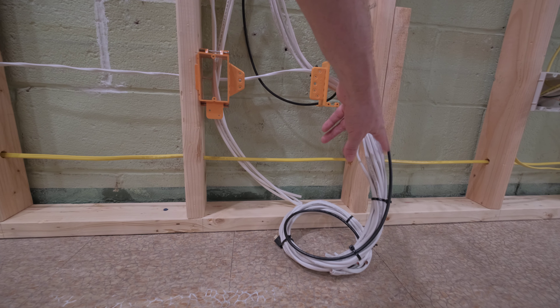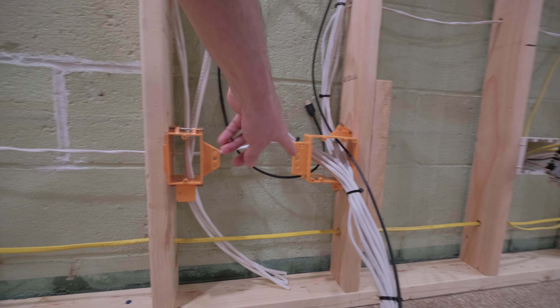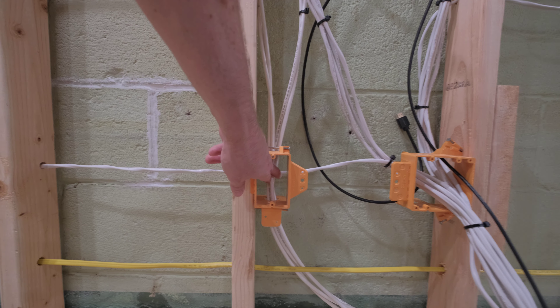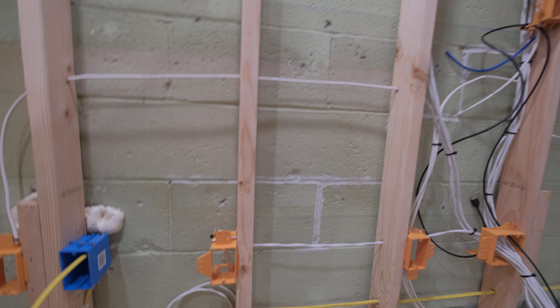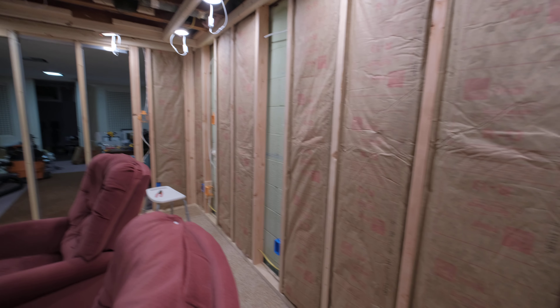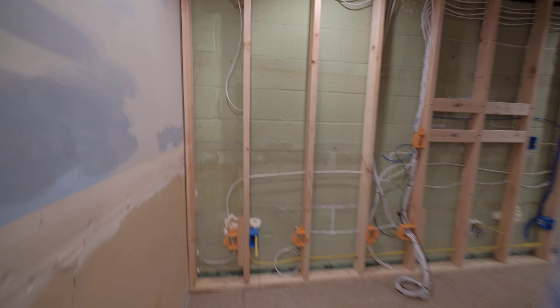I put a rat tail here — I've got the HDMI run and a rat tail of all the speaker wires so we can pull that through the drywall when we do that, because there are so many cables. We did a separate box for the subwoofers, so I ran coax for the subwoofers. There'll be a sub here, another one on the other side, and one in each back corner — so one back here and one in the other corner — just in case I ever want to do four subs or put a sub in the back of the room.